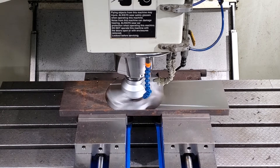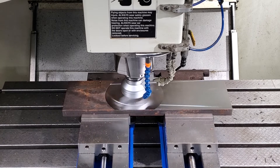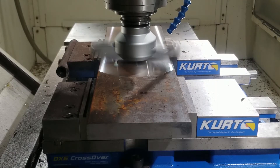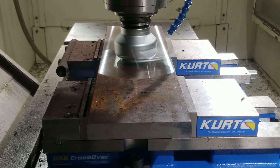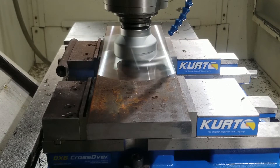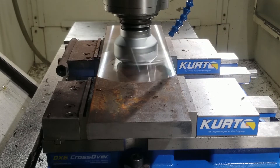This tool will actually cut a ten and a half inch plate just with the seven inch bar. The Suburban Tool fly cutter mounts to a one inch shell mill arbor — the standard arbor available from Suburban Tool — with a CAT 40 arbor or an R8 arbor. It's basically a one inch hub on the arbor with a 3/8 inch keyway.